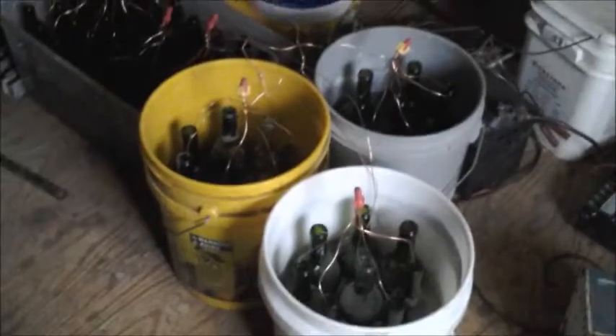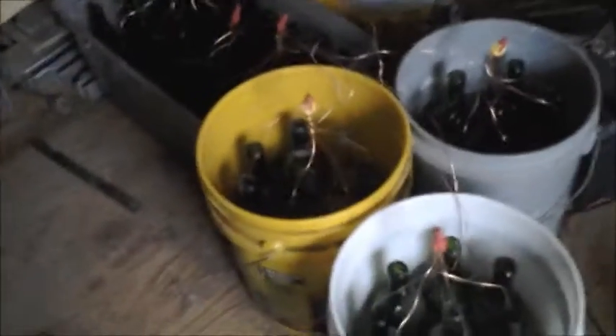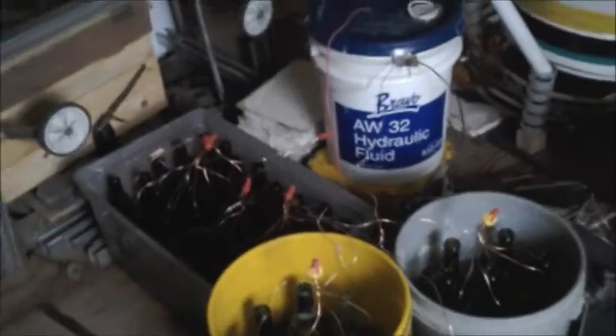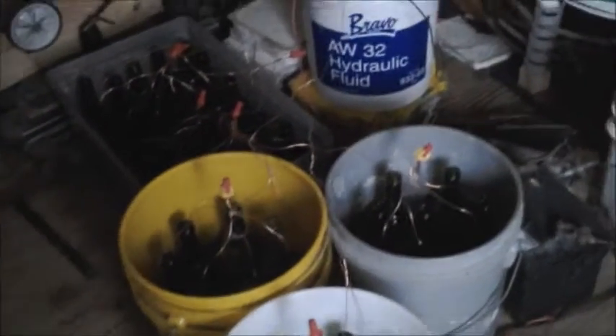Here are all the capacitors: there are seven encyclopedia capacitors, the big hydraulic fluid capacitor, 40 beer bottles, and I have them all connected. I kind of in my head calculated rough numbers for the nanofarads, thanks to my good friend Roy St. Vincent, who has a capacitance meter that told me one beer bottle is about 0.8 nanofarads. I used the JavaTC calculator to figure out where the taps on this should be due to the size and everything, and you would not believe how accurate all of it was.